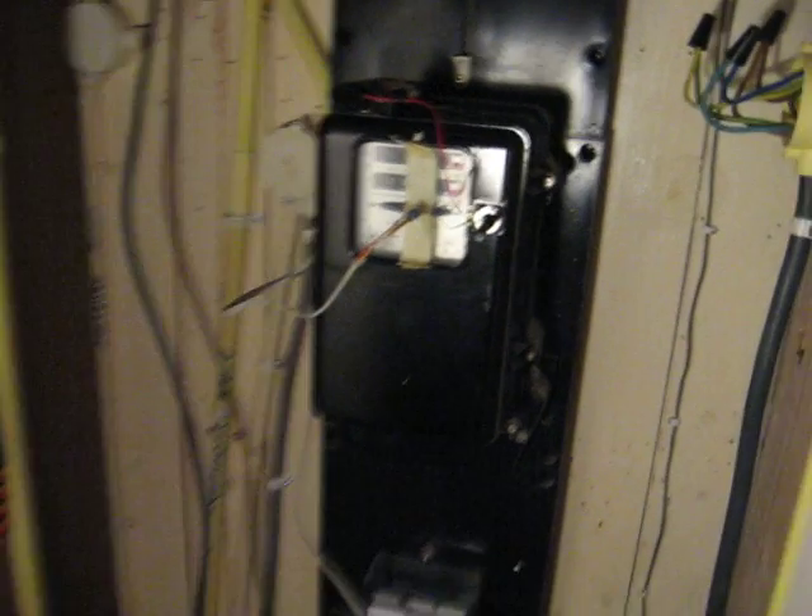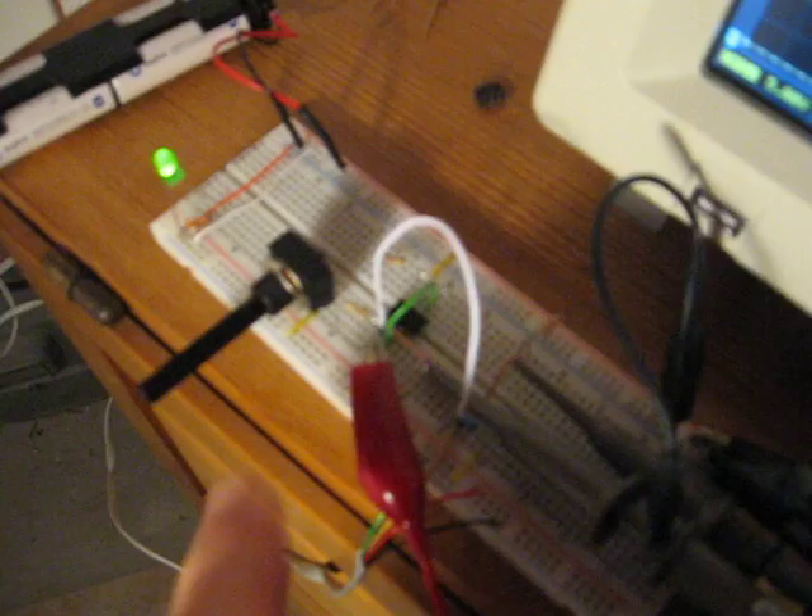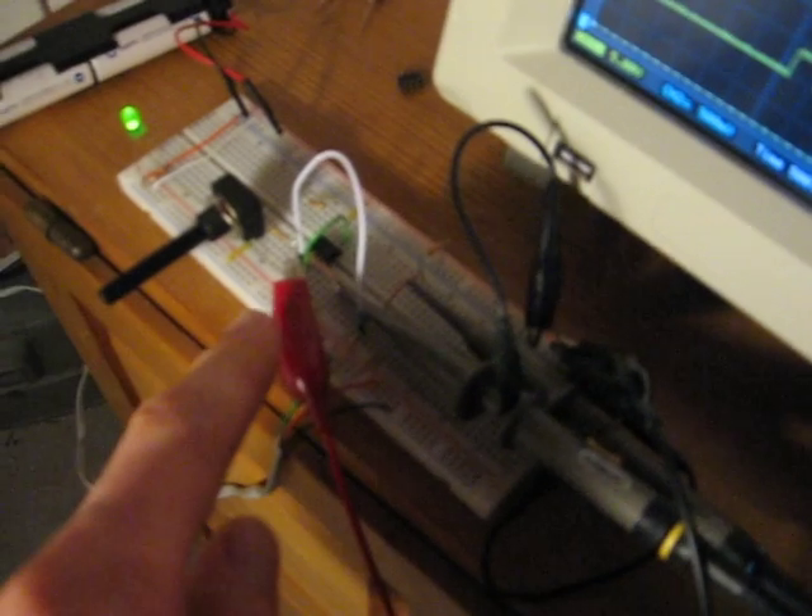In this tube aimed somewhat at that disc is a photo transistor which is detecting the infrared — not only the infrared from the LED, but also the infrared from the light over here. The photo detector feeds into a circuit with an operational amplifier and a potentiometer that gives off a reference voltage.